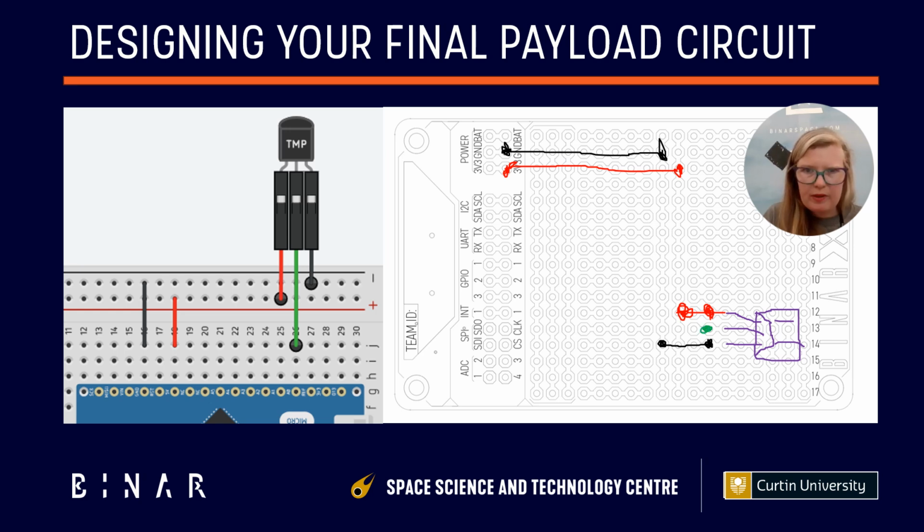there. Now I could do a couple of things because I'm not doing, I could just connect the wire directly from here over to ADC1, but I'm going to be a little bit neater, and only because I know I'm not going to put anything else on this circuit, I'm going to actually use one of these long ones just to be like, okay, well, I'll come over here and then I'll go on to this first one, which isn't connected to anything else. And then I don't need to have a wire running all the way across my board, but this is connected so that I can come right up under where the ADC is. I'm going to go like that. So that's my basic temperature sensor payload for space.